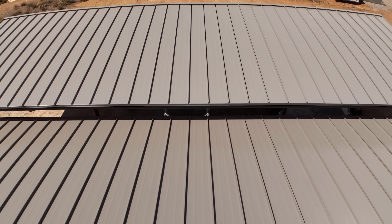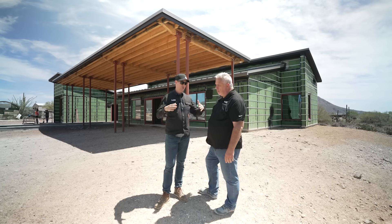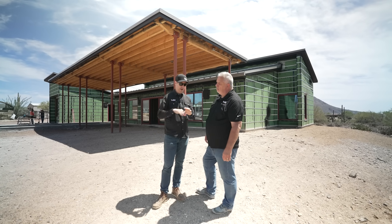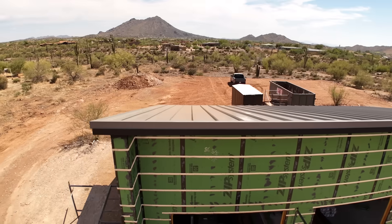The beauty of metal — nice and smooth — we've got good shed action. It's also really good for water collection because you can have a first flush system where, if there's dust and garbage on the roof, the first couple gallons get dumped automatically. But then all the rest of that water gets captured really, really well. And it's a highly durable system.